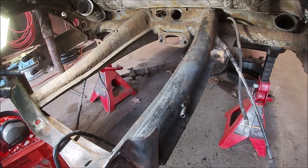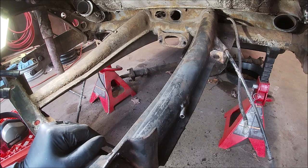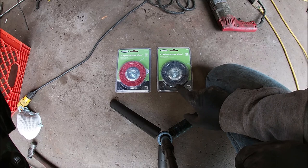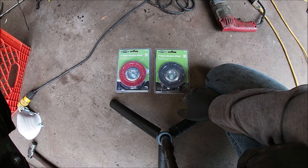I'm going to wire wheel this all up — it'll probably take me about an hour or two. However, you'll see me in about three seconds thanks to film editing. One thing I wanted to show you: I'm going to switch to the nylon abrasive wheels. This is 150 grit, that's 80 grit. I'm going to see how they do, because they can reach in a little further — they're longer than an average wire wheel.